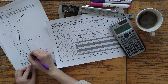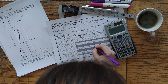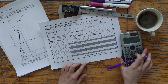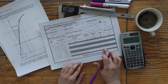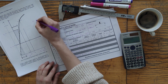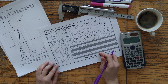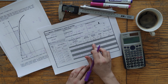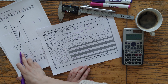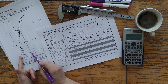Looking further, ε₂' and ε₃' are also produced in this way. We have now calculated the deformations and move on to the bending moment, which will allow us to calculate the stress needed for determining the modulus of elasticity, which — as we said — follows from Hooke's law. The modulus of elasticity we are looking for in the last column is the ratio of some stress to strain. The strain we just calculated. Now we calculate the stress. The first thing needed for stress is the bending moment. The formula is shown here — always insert forces F1, F2, F3. The zero force is no longer used here, because the forces were unloaded only to 2 N, and with this correction we obtained the full strain.